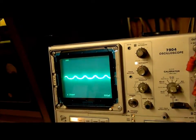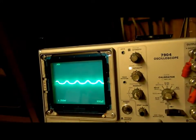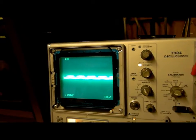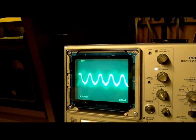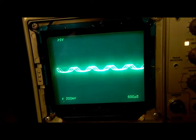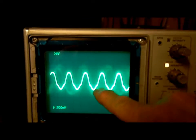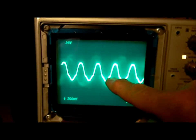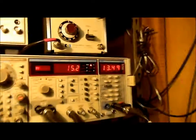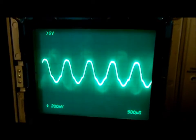It's got some noise in it — maybe loose connections. So now I increase the drive here. Look at that — that's pretty bad. You can see the top part is conducting a whole lot more than the bottom part. Right there is a zero crossing. The output is only 13.5 volts with 15% distortion. Really bad distorted waveform.